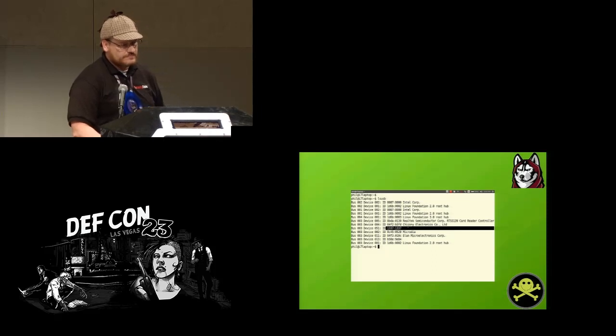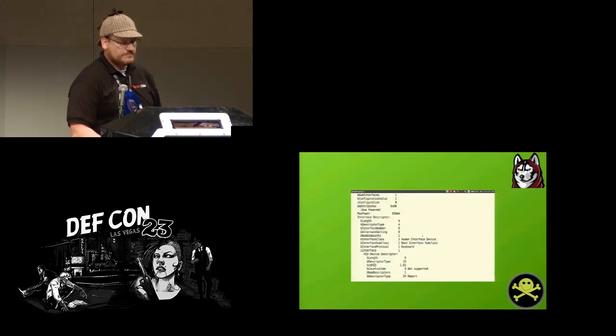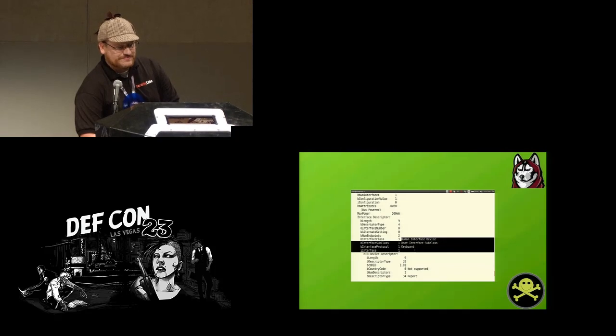I have my VID/PID. Now if I do an lsusb -v -d on 1337:1337, you'll see it gives me a bunch of information. And right here, it tells me this is in fact a HID and it's a keyboard. All right, so now we have a device, but we're not quite ready to do anything useful with it.